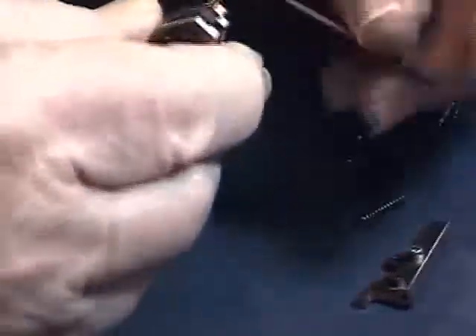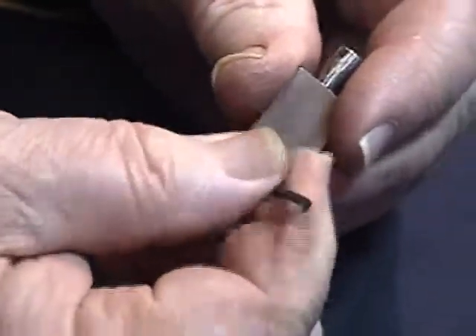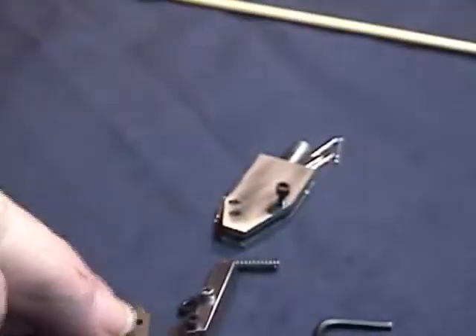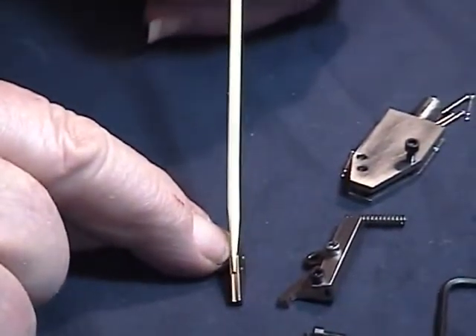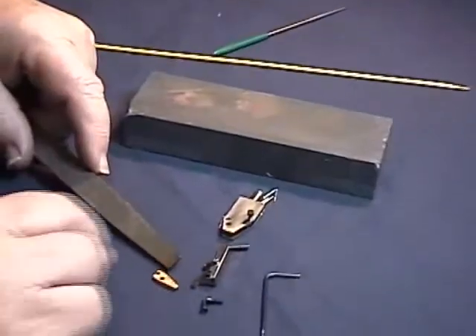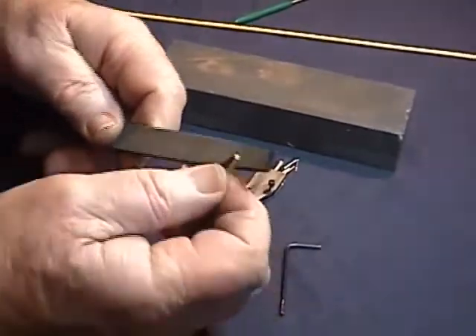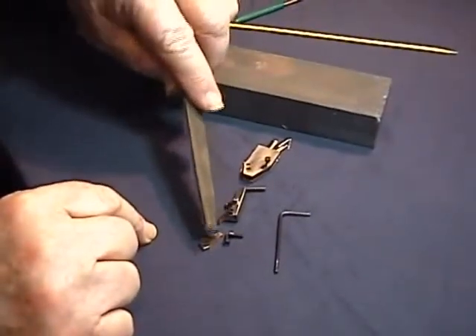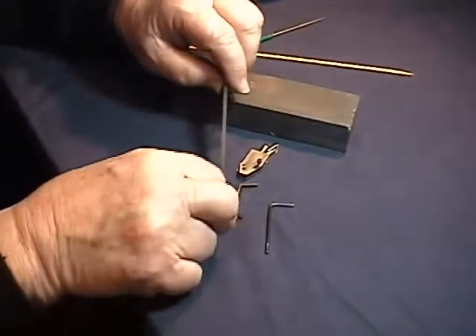Now I remove the front collet shoe — two screws and the front shoe comes out. These two collet shoes, or electrodes if you will, require maintenance, especially on the front surface. This front shoe is the stationary shoe and has a V groove in it. It gets worn out from the constant firing of the post. These are generally replaced as a set every 200,000 to 300,000 welds, when they become worn to a point where they're no good.